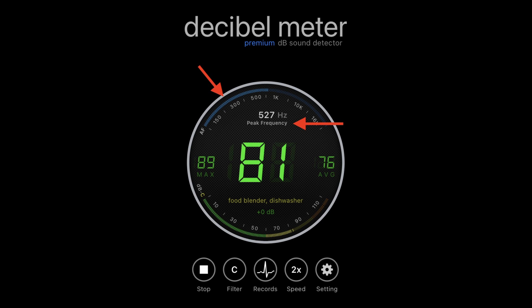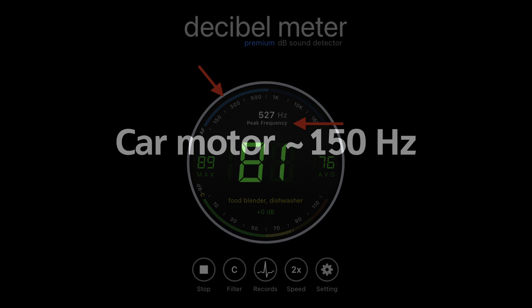I'm going to show you some examples using all three weightings. I'll play some sounds from freesound.org, which are Creative Commons licensed sounds. You'll hear the same sounds at the same volume for all three tests. Keep an eye on how much the frequency levels change. The decibel reading is the big number in the middle, but the peak frequency reading is the smaller number just above it. Watch the numbers in the peak frequency section and the meter fluctuations in the half circle at the top of the app screen. Car sounds might have a frequency of 150 or lower, but when a high-pitched horn honks, it goes all the way up into the thousands — over 3 kilohertz. Let's start with the A weighting.